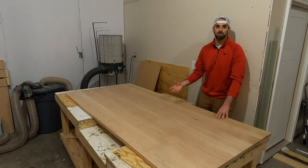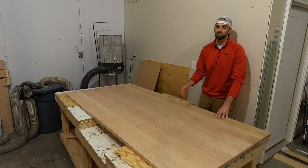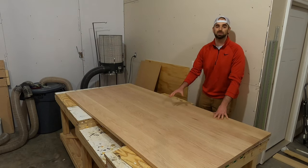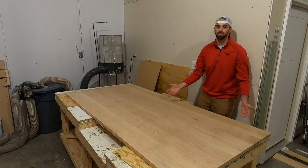So I'm going to take the track saw and rip two boards out here, cutting on these glue seams. Hopefully I'll still have a flat edge — if not I can try to put each one of these pieces on the joiner again. In my opinion these seams are not acceptable and this is not going to work, so I have to redo this. Hopefully this goes smoothly, so let's see what happens.